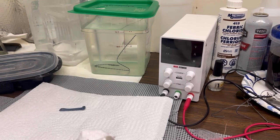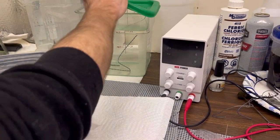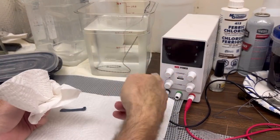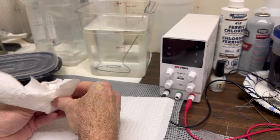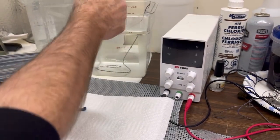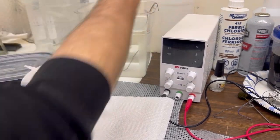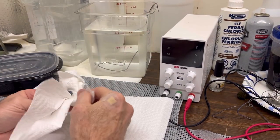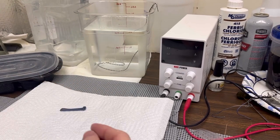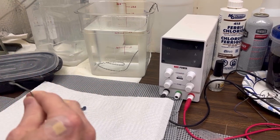Your electrolyte solution is mixed with distilled water and baking soda. Basically, you fill up your distilled water in there, and I put like 3 or 4 spoonfuls in there, and you just stir it until it vanishes into the water and the water's clear again. You need titanium wire to make a coil in your electrolyte solution, and titanium wire to hang your parts on to anodize them and to clean them. The titanium wire will be linked down there also.